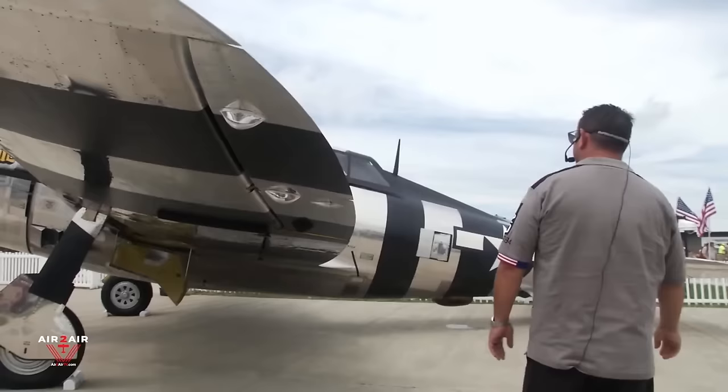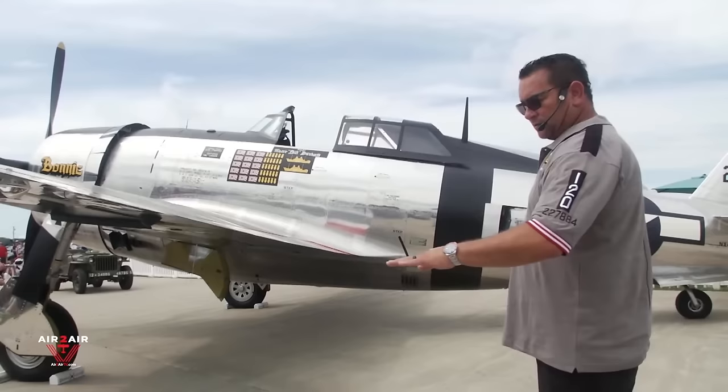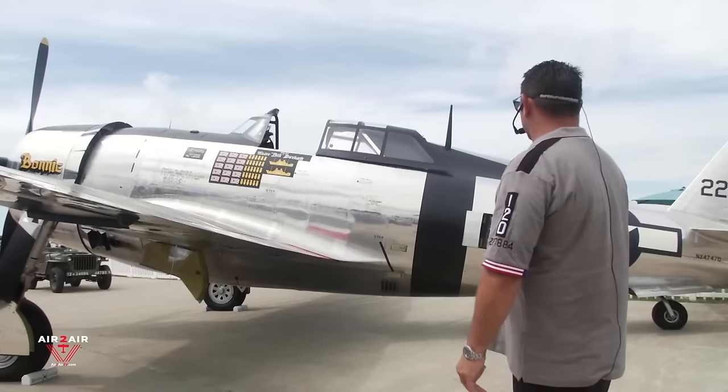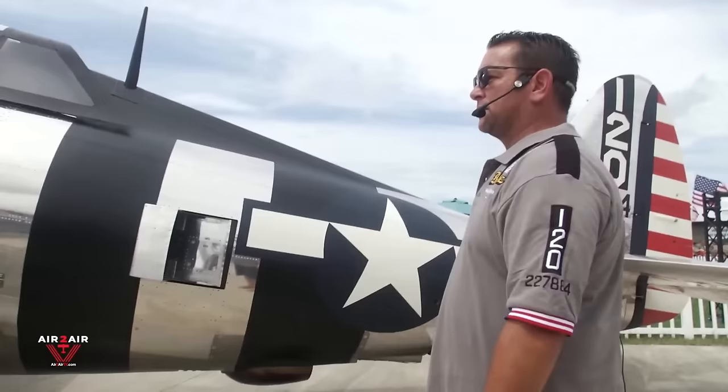Big, giant flaps. It's heavy. As they say, it's the heaviest airplane that they flew. So it's got big barn door flaps. Pretty cool design. They actually go out and then down, which increases the wing area. So it was ahead of its time by a lot. It was designed real early and used quite a bit. Bernie, what kind of speed over the fence typically? Typically, you're going to shoot 120 down final and then come over the fence at 115, 110.